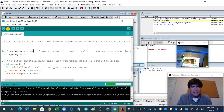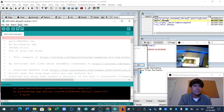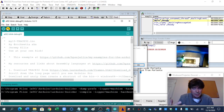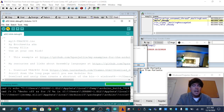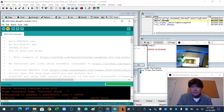Trace32 — incredible debugging. You can go in and look at the assembly language. One thing: I didn't switch to the correct port — that's the blinking port, not the other blinking port. The Portenta has dual core, and making sure you're putting your program on the correct core is a bit confusing. This is for people who are professional with these machines. I'm trying to let the 31 million Arduino users maybe move towards the Portenta, because it's got some pretty cool machine learning stuff.